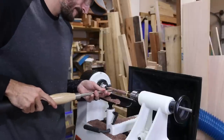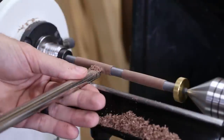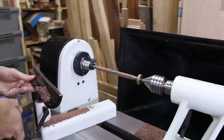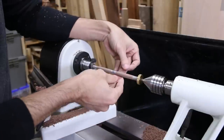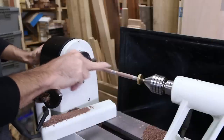I actually left a little more than I needed to, and I'm going to go closer next time. The shape of the blank between the bushings is really up to you, but I went with a very slight bulge in the middle tapering off towards the ends. I moved away the tool rest and then started with 150 grit and worked my way up to 600 grit sanding strips. In between grits I sanded with the grain to get rid of any radial sanding marks.